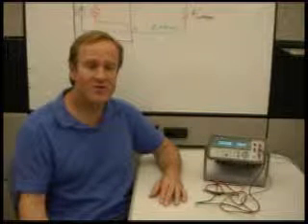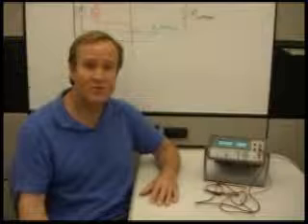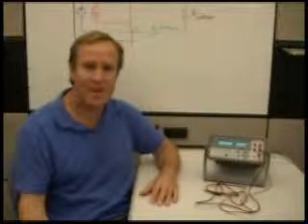Hi, my name is Mike Hawes, and I'm an Application Support Engineer for Agilent Technologies. In this short video, I'd like to describe the null function and how that works with our DMMs to eliminate the lead resistance that we get when measuring with a two-wire ohm resistance. So let's move to the whiteboard, and I can diagram how that works.